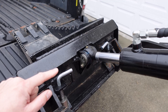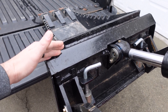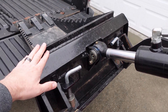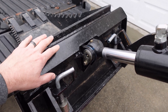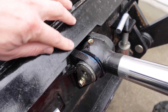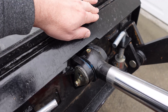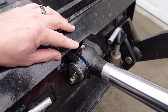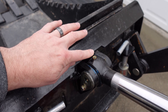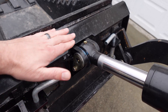The way this mounting plate works: there's a beveled edge on the attachment and a beveled edge on the mounting plate, and you want as much contact as possible from left to right where that beveled lip contacts all the way across — that gives you the greatest mounting strength so it's not jiggling around. When I went to mount this on there, it wouldn't make contact because of this knuckle. So modification number one was making a cutout so the knuckle can go in. You also want enough space where it clears that grease fitting, so when the bucket curls up, the metal doesn't clip that off.